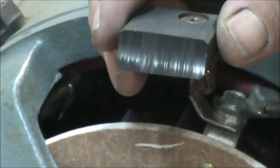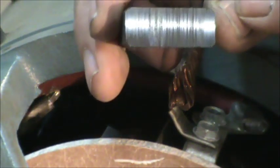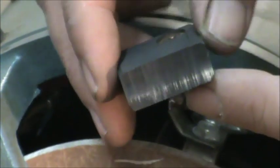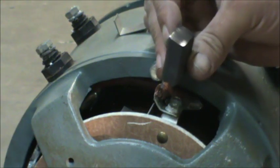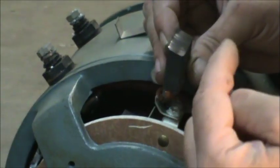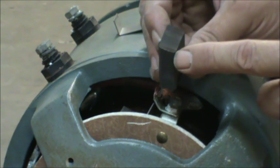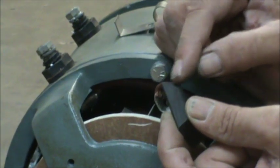Hopefully you can see the scratches here on the brush. I'm a little surprised it would be a hundred percent — there's a little bit right here on this corner that's not seated in yet. You can see it has a radius, a bit of a curve in there, because it's matching the commutator. This is a curve on this surface right here. When the brush is new, it probably looks more like the end here, which is basically an angle.